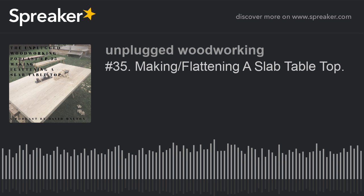So all the way through this build, I haven't really mentioned that if you are doing this, you need to keep your plane iron sharp. I bang on about this all the time, and you're probably sick of hearing us say this, but obviously keep your tools sharp. The plane irons, what might be a good idea, it depends. I'll be honest with you, I'm lazy and I don't really like to sharpen, but you've got to do it. So it might be an idea, just say, for instance, if you're only intending to use your number 5 for this, you might have a number 4. So it might be more beneficial for you to sharpen the number 4 blade, the number 5 blade, and a cambered blade all at the same time.